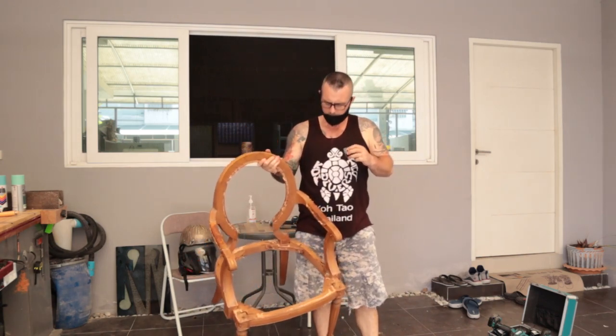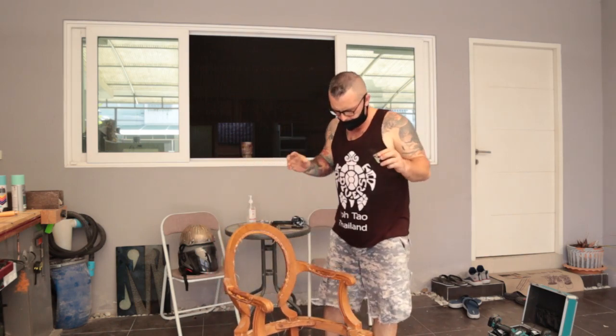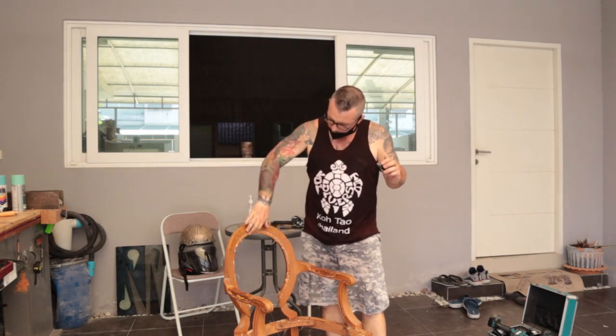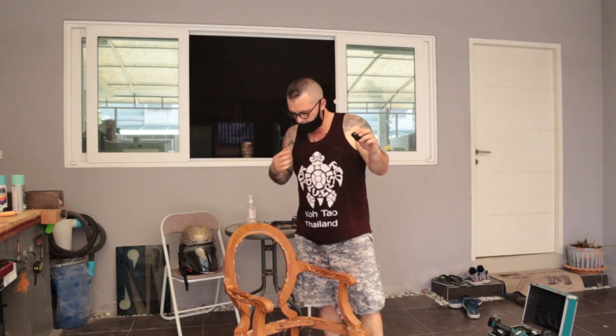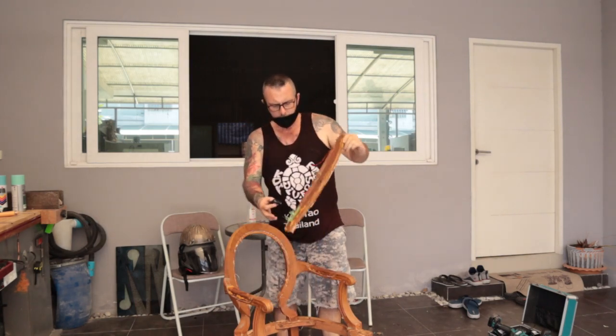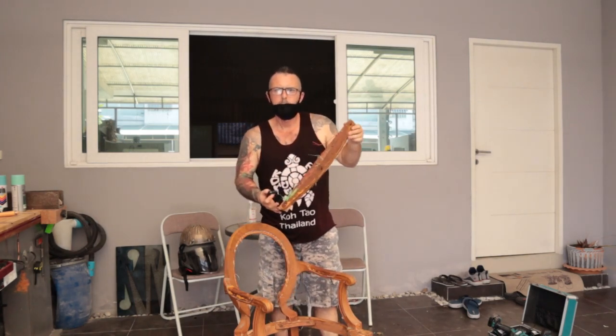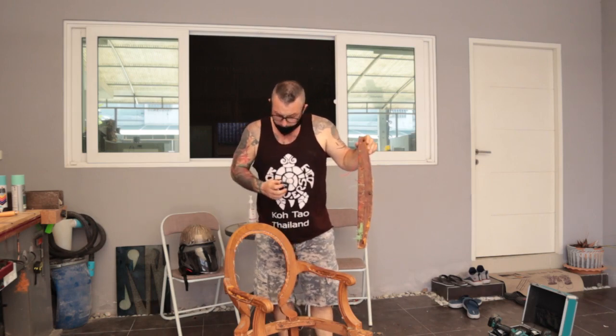Throne pretty much stripped down. I need to use some wood glue and some screws, and there's a couple of loose spots that I need to tighten up and get a couple more staples out of it, and then we just sand it down, and I need to figure out what kind of material I want to use. The braces that the cushion were stapled to that go around the inside here, the wood's kind of rotten, so I'm gonna buy some more wood, cut out the pattern, and redo brand new pieces for it. And then we'll go from there.